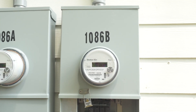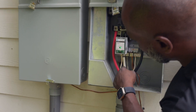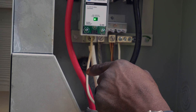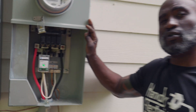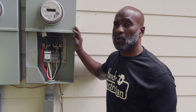This is a meter socket — this is the meter that Georgia Power reads, this is where the power comes in. This is called a mast, that's the weather head. The homeowner owns from the black on down this way; on that end Georgia Power owns that, and they own the meter. But if you zoom in here, they screwed into this wall into this Hardie board, and it had an electrical explosion. You can see the black marks exploded over here on this wiring. The screw was too long and it hit the panel on the inside.